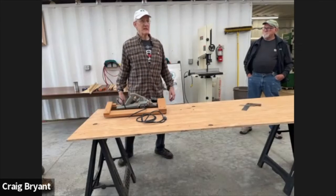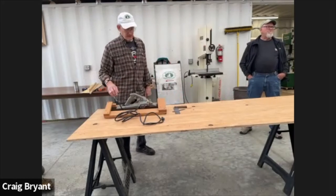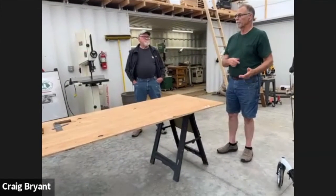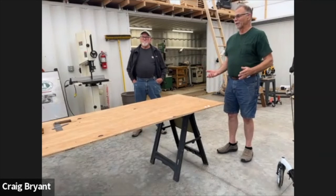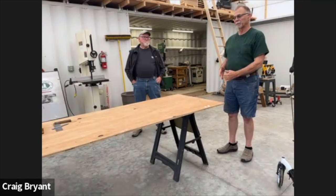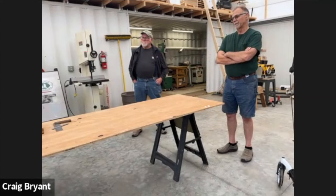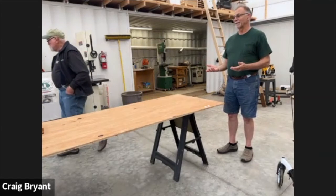Any questions about it? One point about all of these jigs: we talked about making an 8-to-1 or a 9-to-1 jig or a 12-to-1 jig. It really doesn't matter very much. If you make one that's 9.4-to-1 and you use it to cut both faces, they fit perfectly. So it doesn't have to be very accurate. What you want is long enough faces so you have a lot of glue area, and not so steep that you're just tearing out the end. That's why plywood is hard to take past 8-to-1, because it's such thin stuff. If it's 10-to-1 or 13-to-1, it'll all work as long as you use the same jig to cut both faces.